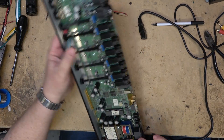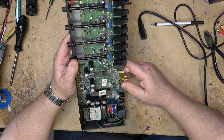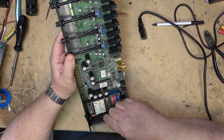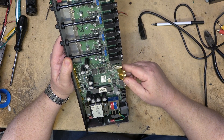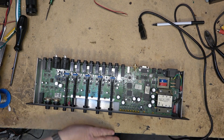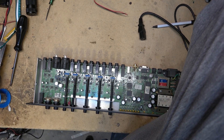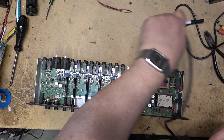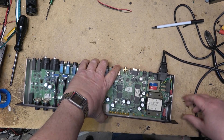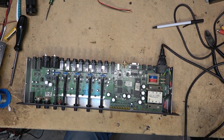I don't really know a lot about this and have no info on it. It's from 2001, it looks like it's got a conventional power supply, and the fuse has been removed. What we're going to do is power this thing up without a fuse — I'll put it on my current limiter — so if there's a problem it won't blow anything up. We'll just bypass the fuse and see if this thing will fire up.